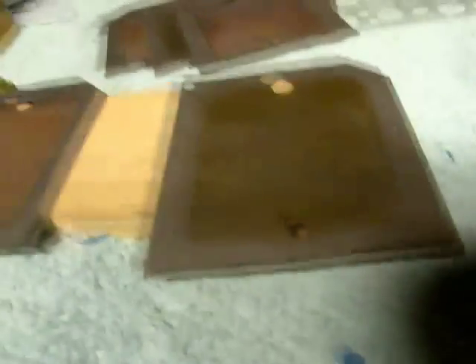I also put a tube in there with a slit in it, which I think contributed. But I believe I was getting gas restriction on the output, so I enlarged the hole. It used to have this 9/32nd hole in the bottom and the top, and I've enlarged the upper hole to half inch.